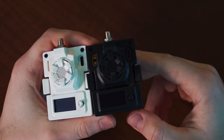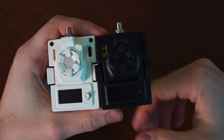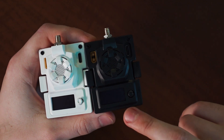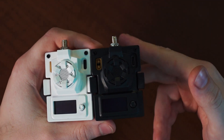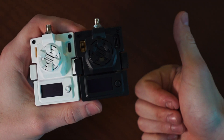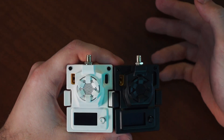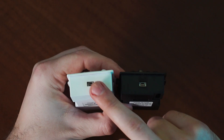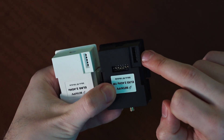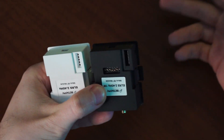Backpack is a feature that basically allows you to connect to other gear you have like your goggles and VTX, and you can change via ExpressLRS your VTX channel and VTX power - it changes both in your goggles and in your VTX, but you need extra hardware to do that. And lastly you have these two extra ports which are basically to replace the module bay pins if your radio doesn't have them.